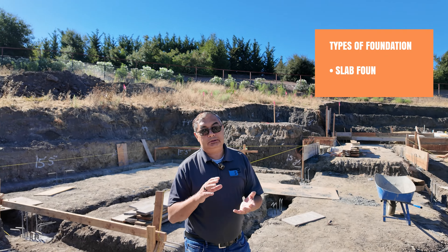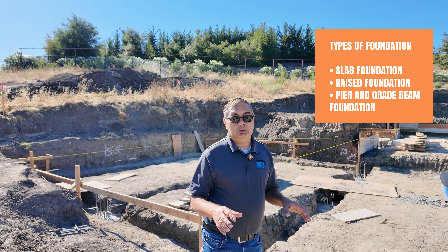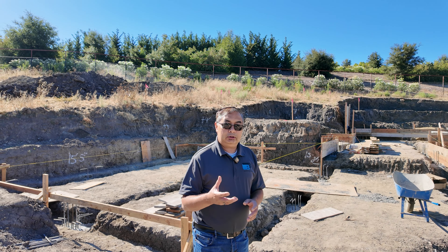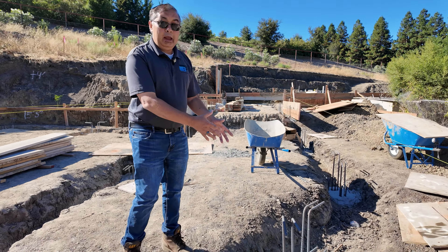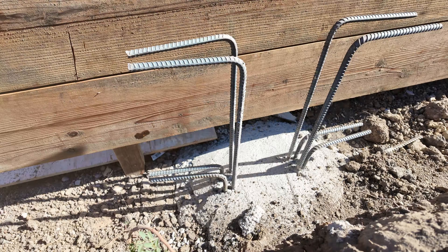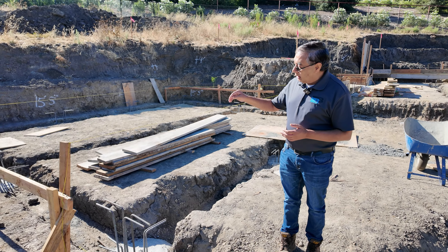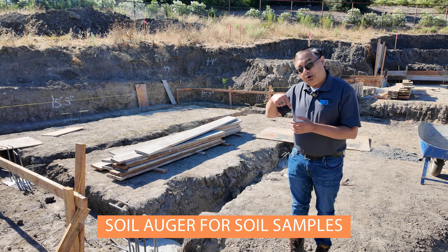Then they let us pour the concrete and finish the foundation. There are three types of foundations: a slab foundation, a raised foundation, and in hilly areas — specifically in areas with what's called expansive soil — the third type is a pier and grade beam foundation. That foundation entails having a lot of piers. The diameter of each pier, the type and amount of rebar, and the thickness of rebar are all determined by the structural engineer, with the soils engineer also involved.